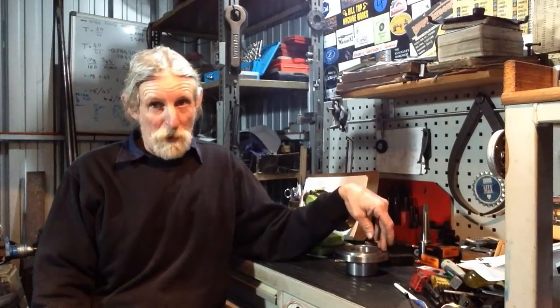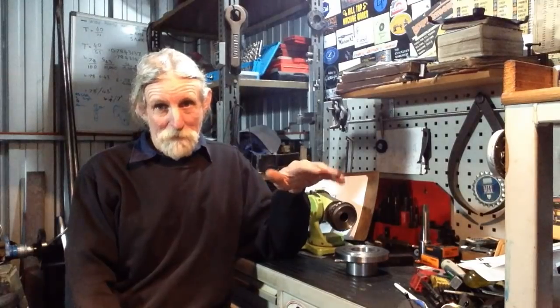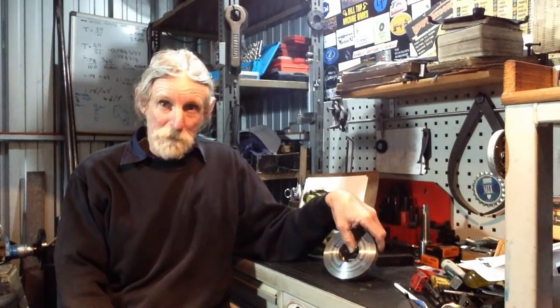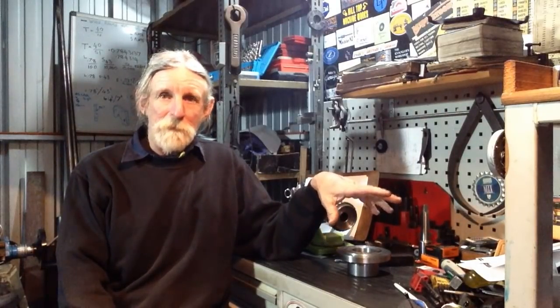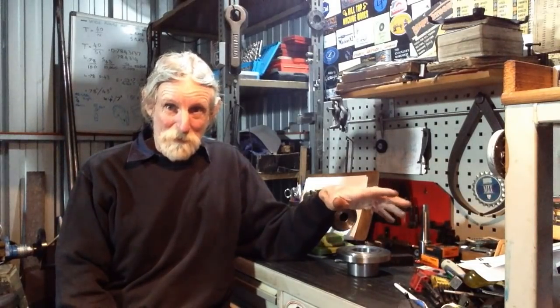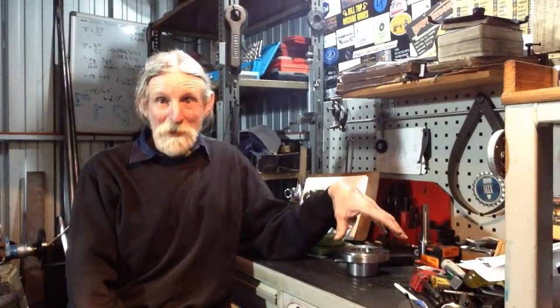I'm confident we'll go close, but we may only get within half a thou also with the soft jaws. So we were under half a thou with this, so I thought, bugger it, rather than having to reset it and muck around too much and kick myself, I went ahead and did it now.